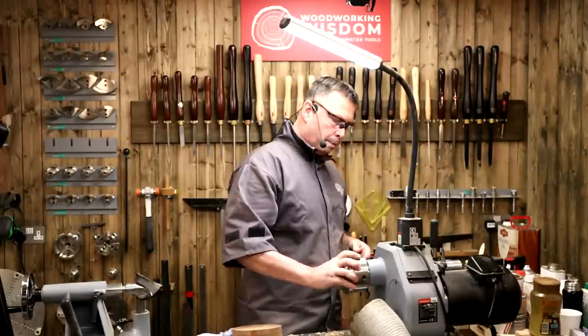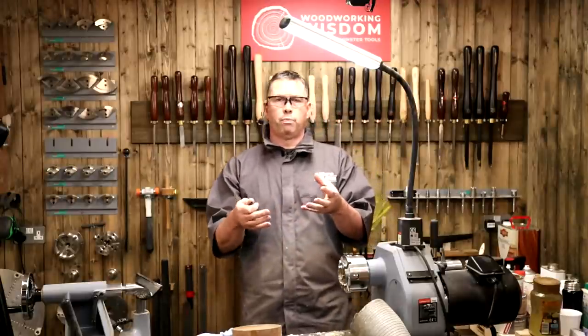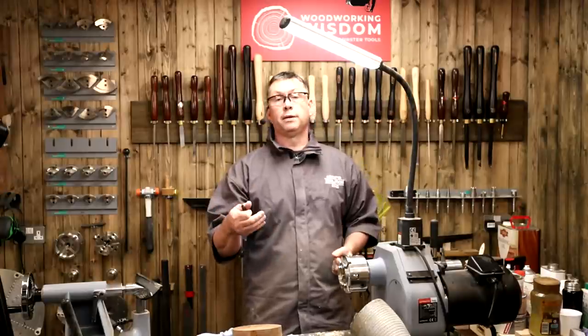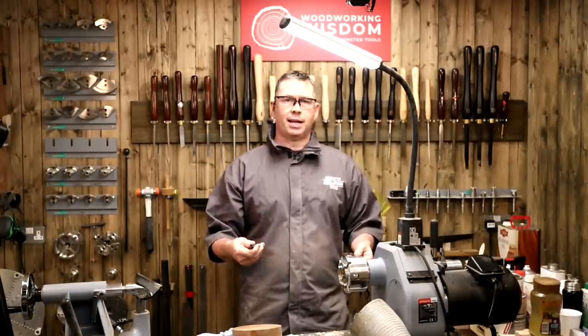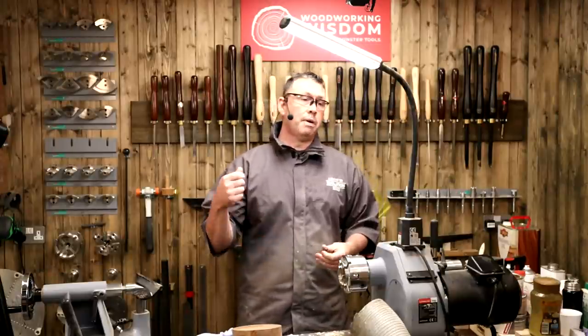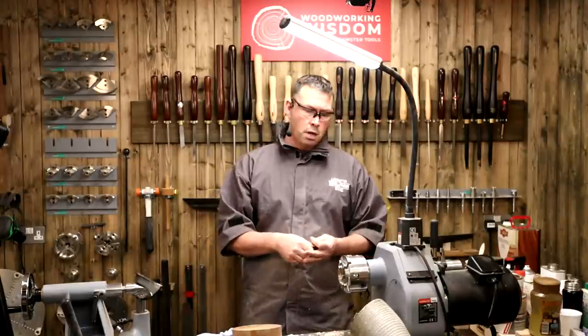Well, if you're rough turning, you want to put something on it to help in the drying process, to help stop splitting, then a PVA is the best thing. You can get building cement additive, in big 5 liter drums, PVA cement additive. Mix it with water in a bucket and brush it on the end grain. That's the best thing to do.